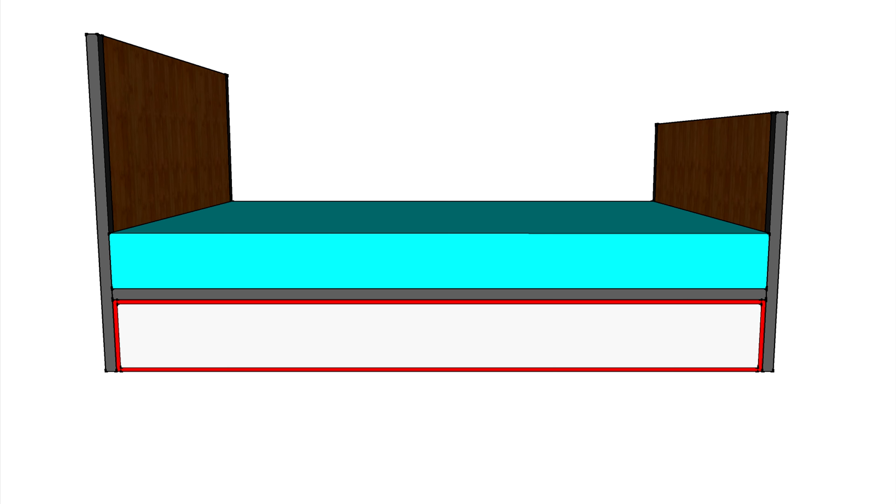For these drawers I'm going to recommend using some wheels — it makes them much easier to slide in and out from underneath the bed, so when you're getting your measurements take those into account. I'm going to link the ones I'm using in the description below and on my blog post — that's an Amazon affiliate link. The clearance I'm allowing for these wheels is 10mm, though you can go a little higher or lower. If you do use wheels, allow for that 10mm space at the bottom. There also needs to be clearance between the drawers, so I went with 12mm again in the middle.